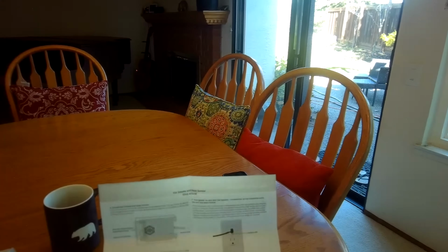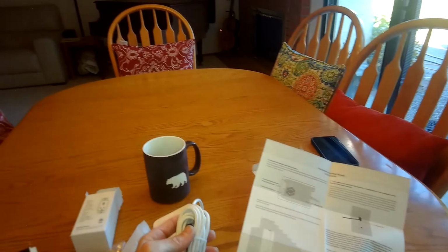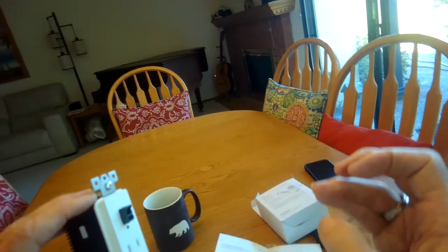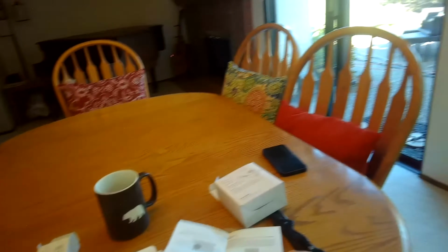Oh, that's cool. So if it did get triggered and now the situation is cleared, there's no more problem, you're still going to have that alarm going. And to stop that, you just take this black modular plug, remove it from here, and then that'll cause a reset, and then just put it back in there and you're done.